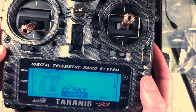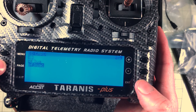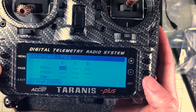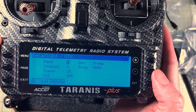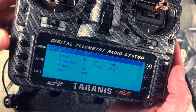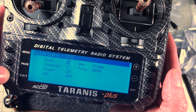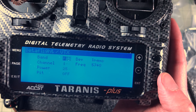Last thing we want to do is make sure it works on the radio - hold down the menu button and page and go into Betaflight and Lua. I'll have a video for this soon on the QX7 Plus getting that updated and working, especially now that I have a model with it ready to go. Execute. Here are all my PIDs, my rates, my filters, and my PWM. Under RX, here's VTX - I'm on R1 25 milliwatt right now. I'll press enter and change this to Fatshark 1, save, press and hold down menu again, save page - and it changed it. That's just gorgeous right out of the factory. For a quad this price, the setup is outstanding. Change it back to Raceband 1 - I'm set up and ready to go and my video is back.